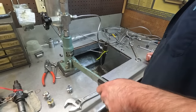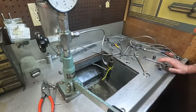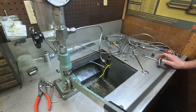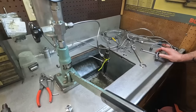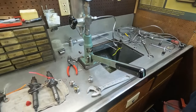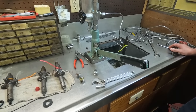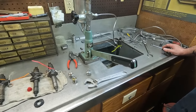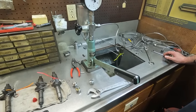So in that case, you're probably dumping more fuel into that cylinder, I guess. And with it not atomizing, it's not really combusting that fuel. Yeah, and then more of it gets sent out through the exhaust? Yes. That makes sense. Now, would that be in the form of black smoke at that point, or would it be white? Hot black smoke, that would be, because it's still compressing in the cylinder and turning black.